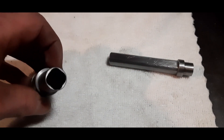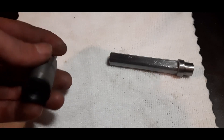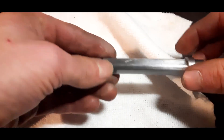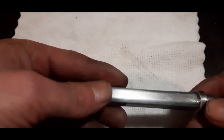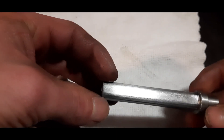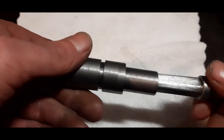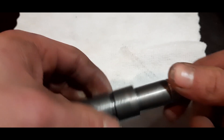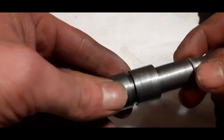All right, these are the parts finished. This took a lot of filing — I really don't recommend doing many of these. This one was all right. Just put it in the vise, start with one face, then use the face you just did as a reference for the second face and so forth. It's basically all eyeballed but it works. It does have some play but it's never going to slip through. I'll put some heavy grease in there.